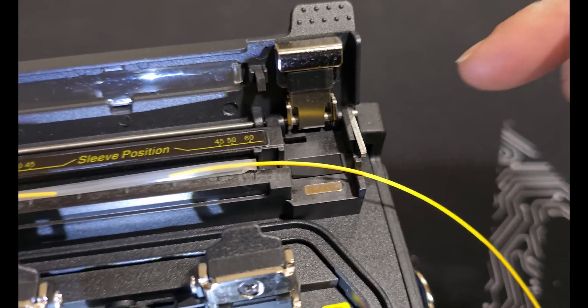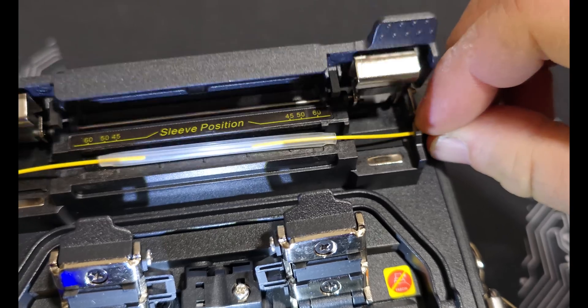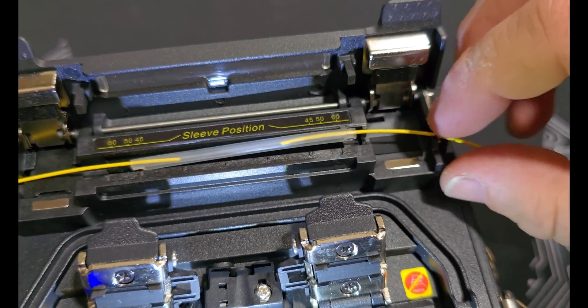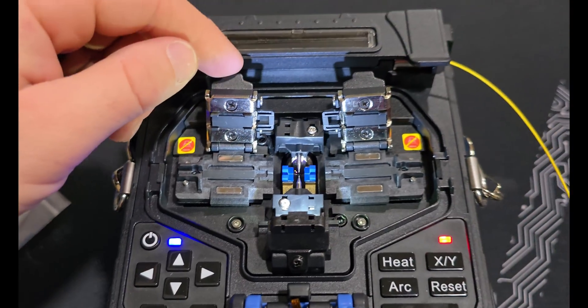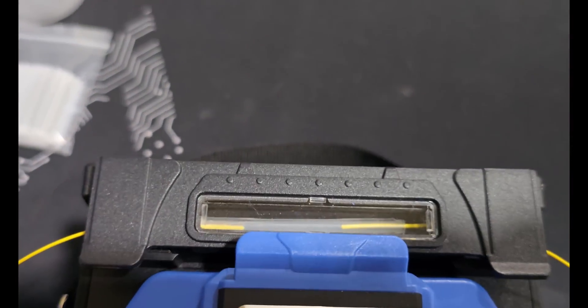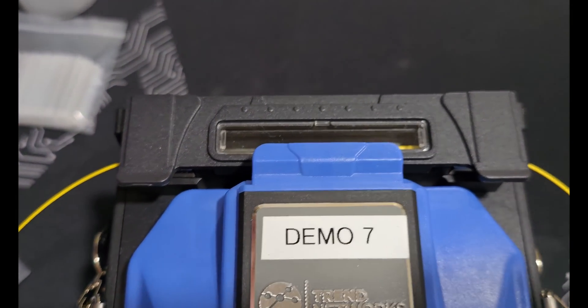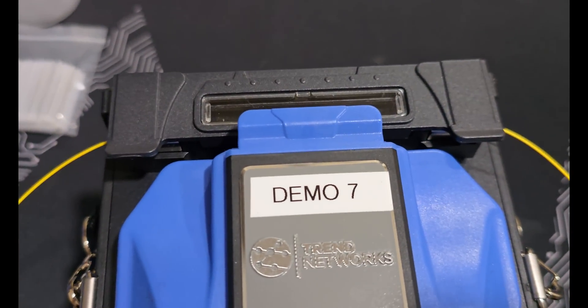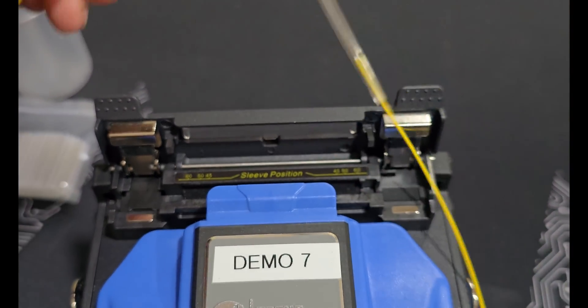You press it down and it shuts the door on the heat shrink sleeve. You can see it start melting in there. Then you close the two doors and wait for it to heat shrink — about 25 seconds for the 60 mil tubes. If you're doing a 96-count cable, you'd have one in the splicer, one in the heater, and one on the back cooling tray. It beeped to let me know the heat shrink is done — you open it up, take it off, place it in the cooling tray, and your splice is done.